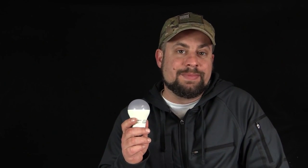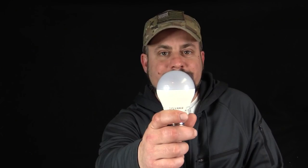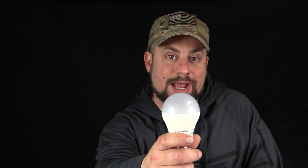Take this LED light bulb, for instance. This LED light bulb draws about 7 watts. If you leave it on for an hour, it draws 7 watt-hours of energy. If you figure that you're going to need this light bulb for 4 hours a day on average, put it down for 28 watt-hours of energy. Need 10 of them? It's 280 watt-hours.